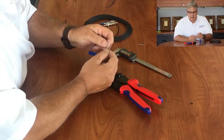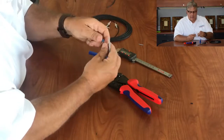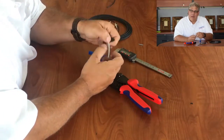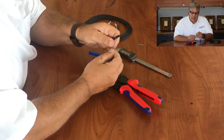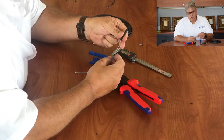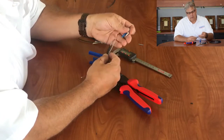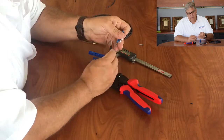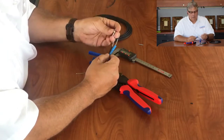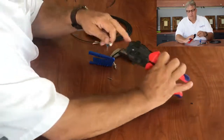What's truly unique about the light seal series of connectors is the ability to swage the end of the connector around the fiber, which eliminates the need for epoxy. For most duplex installations, you'll want to use different colors of strain relief so the installer knows what channel to look for. We'll go ahead and slide the connector on.